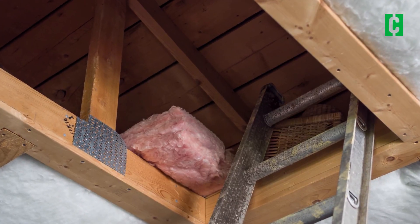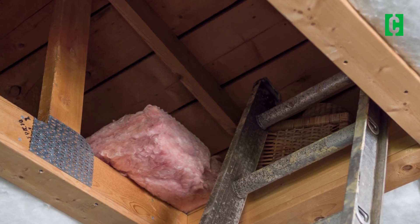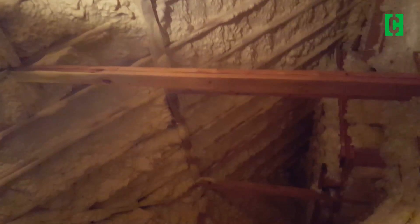The next thing you need to do is use the results from that blower door test. Get in your attic and find where all your leaks are. The most expensive thing you can do is to use spray-in foam insulation in your attic — spray the whole thing, foam the whole thing. You can't do that yourself. But that is the single best insulation you can put in your house. It'll seal all the cracks and seal everything in your attic.